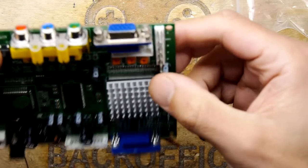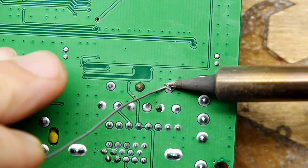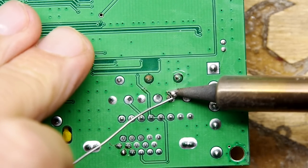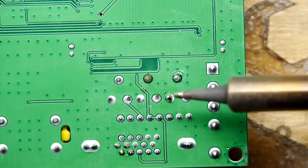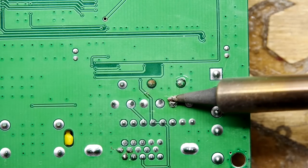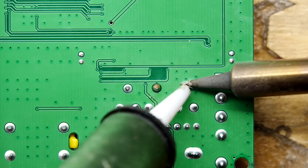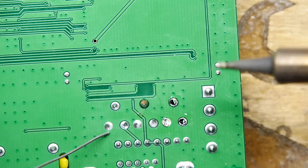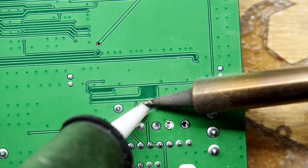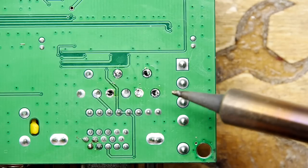Small potentiometers - or variable resistors if you prefer - let's just get in there. I've got my new soldering tip which is still looking pretty new. This board is sinking heat like mad so you might even need flux - if you've got some flux definitely use it. You can see that's working pretty well with just the addition of a tiny bit of flux.